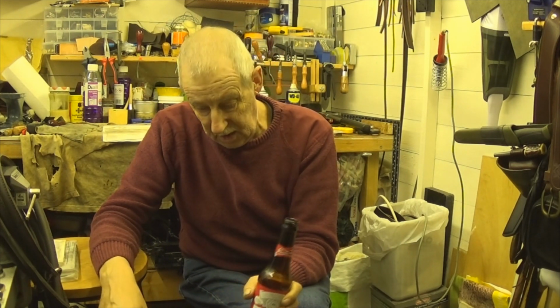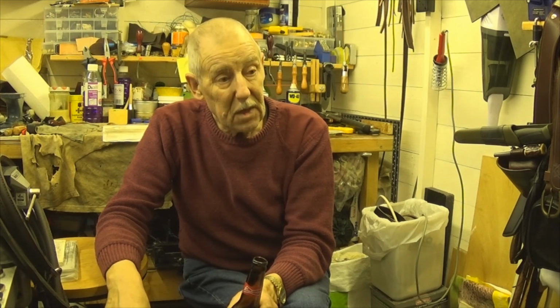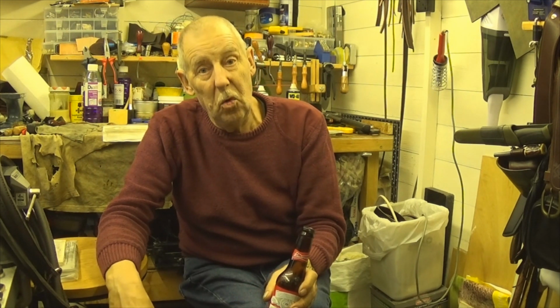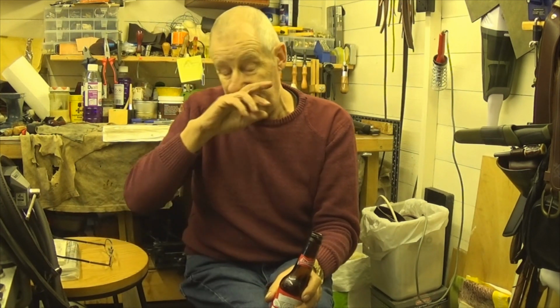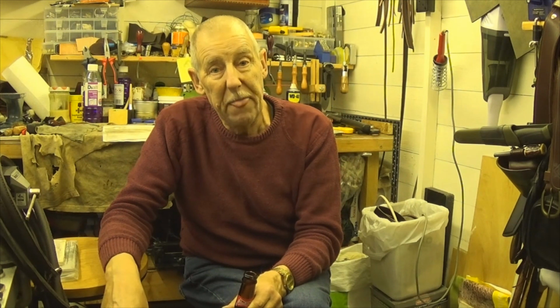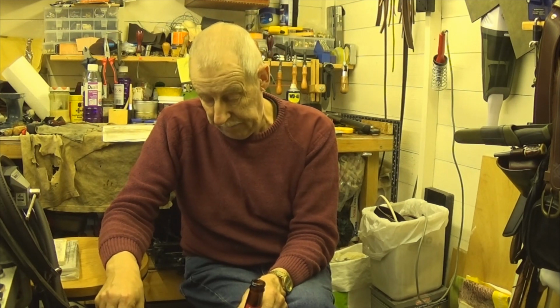But as I say, I had these guns. I'll be honest, there's two there, and there's two indoors, and there was one, two, three, four. I had eight guns in total, eight guns here, that wanted just a quick refurbishment, only small jobs. But anything that needs reproofing, I don't touch any of that. I say you need to take it to your gunsmith, because that will need reproofing in the proof house, of which I'm not licensed to do, so I have to put that onto the gunsmiths. But a lot of it is just touching up the bluing on barrels, maybe a little polish work. Some might want their stock completely stripped and re-dyed and stained and polished.